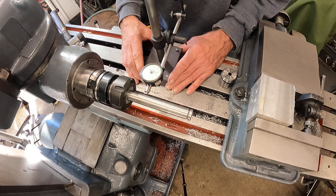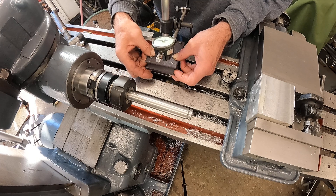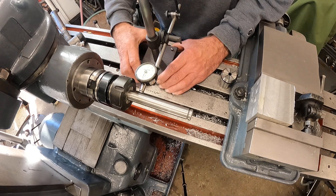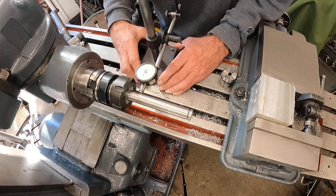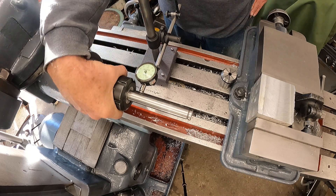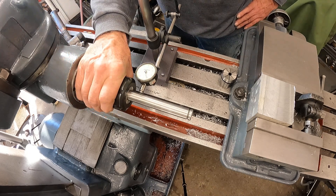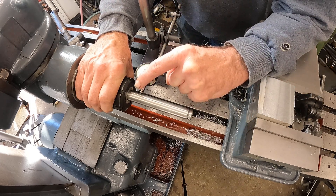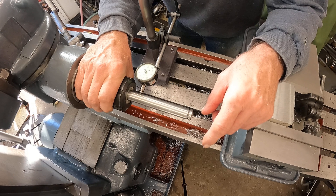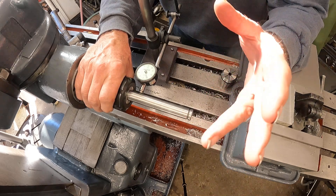I got the pins in - it's causing problems. Let me set those pins up, get it over here on zero. How could that be - three thousandths runout right there, and it only runs out one thousandth right there. That's because I tweaked it in the collet, and that's an important tool if you want things to run straight. That's why you watch this channel - I've never seen anybody show some of this on YouTube.